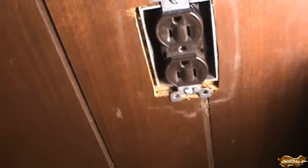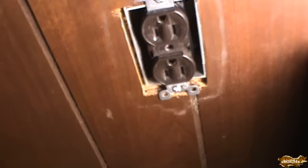I wrapped the outlet in electrical tape. Some would debate whether or not you need to, especially in modern plastic electrical boxes, but this is a metal box, so I like to have that extra little bit of insurance there. As I stated, these boxes are tight. The thing really working in my favor is the fact that this particular outlet is using 14 gauge wire, so that gave me just a little bit more room to work with. When I did some other outlets in the house that was 12 gauge and it was a bit of a fight. The 14 gauge is a little bit thinner and softer — gave me just that little bit extra, especially here behind the bed where I don't have a lot of room to work.